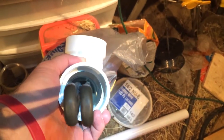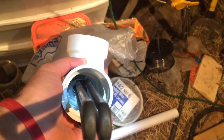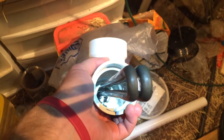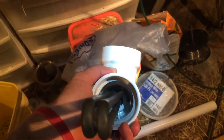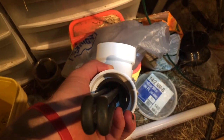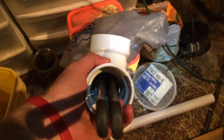What's key is you can't have this metal element touching itself anywhere, and you can't have it touching the plastic. You can see I've got at least a quarter inch of clearance between the element and the plastic down there in the bottom where it folds back on itself. If you can find a straight element that's not bent around like this, that'll help a lot, but all I could find was this bent one from Home Depot.